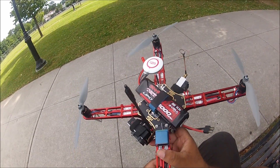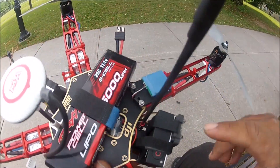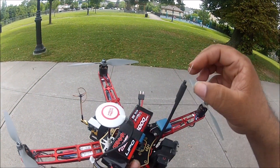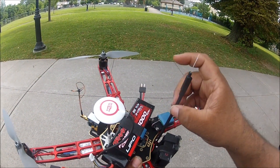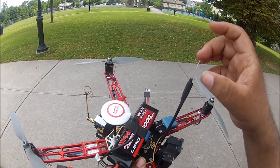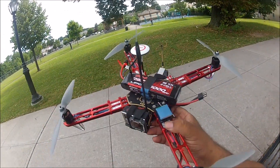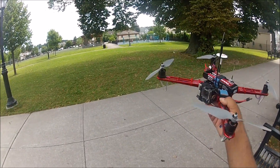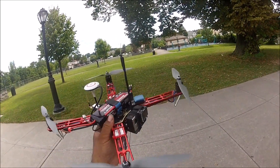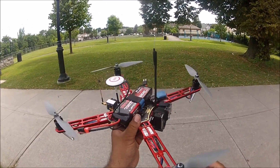The antenna of this receiver is mounted using an RC car antenna tube mount, right behind the GoPro. I use a black antenna tube and secure the antenna into it with heat shrink. It's mounted nicely so the receiver gets maximum reception — regardless of which direction the aircraft is facing, the antenna is always going to be in line of sight with the radio.